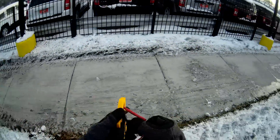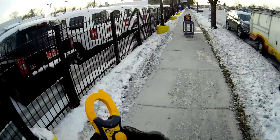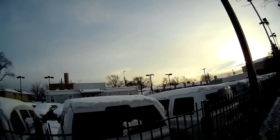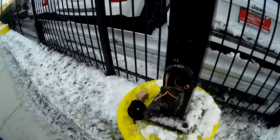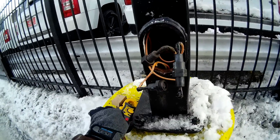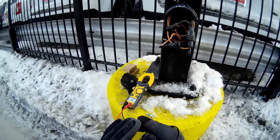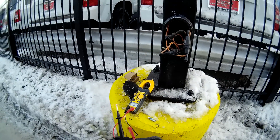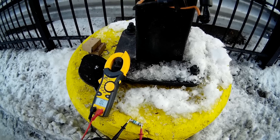Okay, let's see what we've got. I already went to the source — over there you can see the pole and everything's feeding out okay, I've got power everywhere. So the sign in the middle there — that's continuity. It beeps, so let's test this other one. Nope — bad fuse.